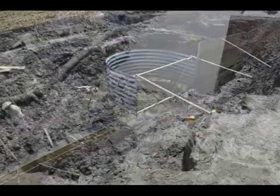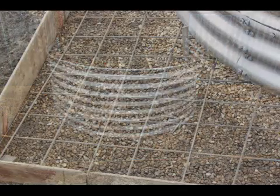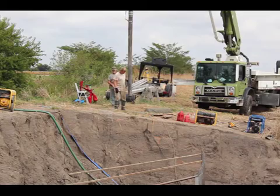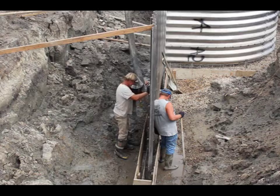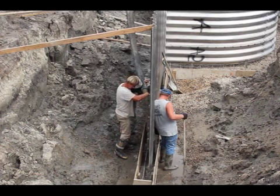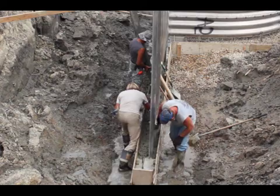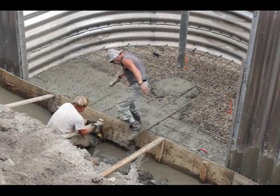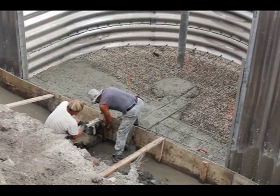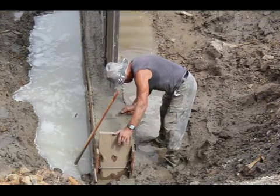The trench is too full of water, so the pumping rate is increased. Rebar is installed to add strength to the concrete pad and footings. The pumper truck has arrived and we're ready to pump concrete into the forms. There's still too much water in the trench — notice how water is being forced out of the bottom of the form as the concrete is pumped in. Workers pull the concrete into position in the form, making sure the material is evenly placed, while holding the form wall in place. Concrete is also needed in the splash pad area as well as the footings. Once in place, the concrete surface is leveled off and smoothed.